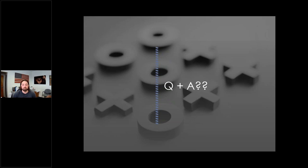Q&A: Can these parts be post-processed or machined? Absolutely — both pre-machining on the green part and post-machining after sintering are possible. You can consider pre-machining after printing if it makes sense for the material and design. Post-machining is certainly doable — the part is as close as you can get to raw material, though there may be small spots of porosity that could be a concern depending on what you're trying to achieve.